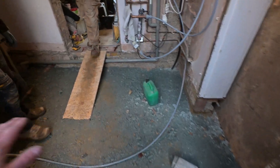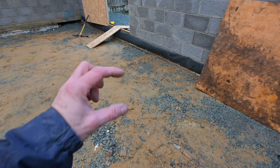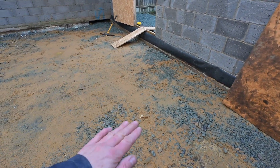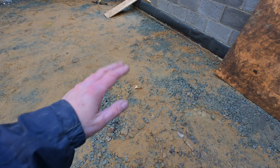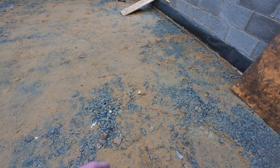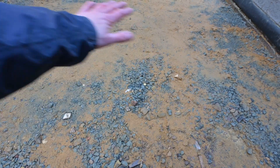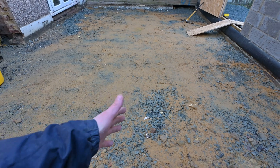All these little areas here will also be concreted, so that's ready. The next stage is laying a layer of sand, about 40 to 50mm. That sand is only there to protect the DPM membrane from getting cut by the stones — there are a lot of sharp-edged stones, so the sand protects the membrane from getting damaged.